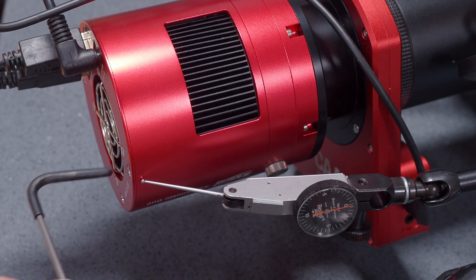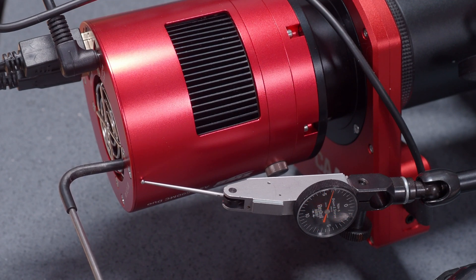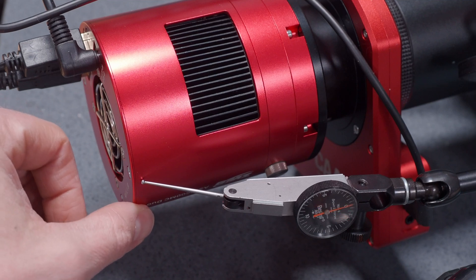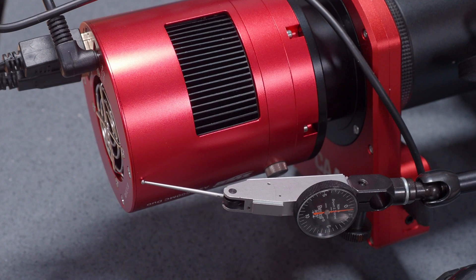On this particular test we are going to go to the right — two pounds. You can see just how much it went: about sixteen thousandths. There's a little bit of memory as well, about two thousandths right there where it didn't quite spring back. We could push it the other way and see — it's just about stopping right where it was in the beginning.